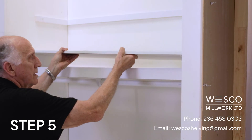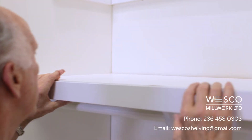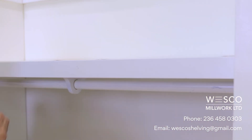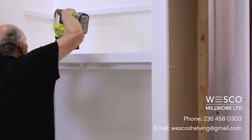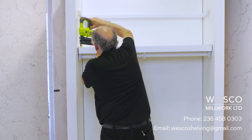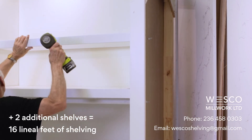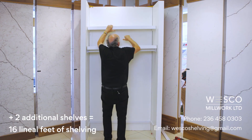Lastly, lay the piece of 5/8 by 16 inch shelving inside the frame. Note that the shelving is supported on all four sides. For additional strength, put several nails along the edge of the shelving into the front board. This is the key to a strong, durable, attractive shelf — it exceeds industry standards for weight-bearing.